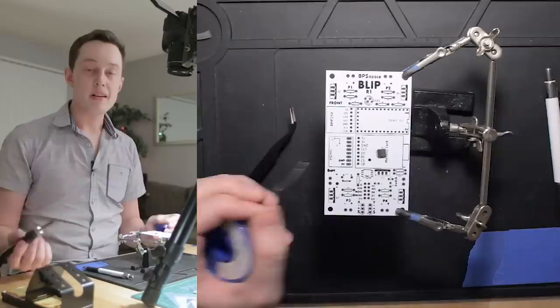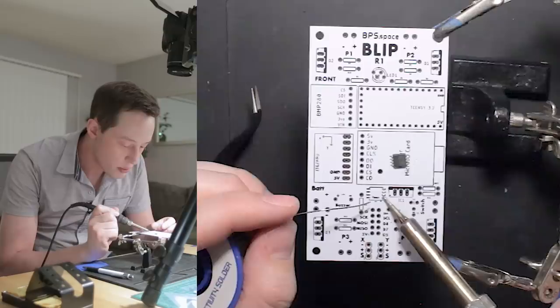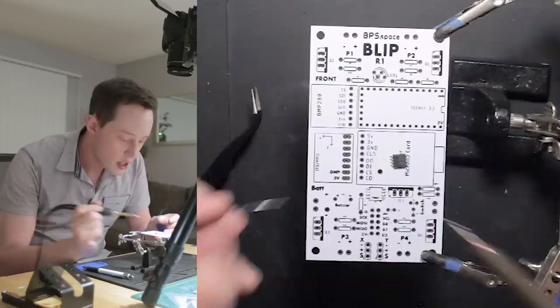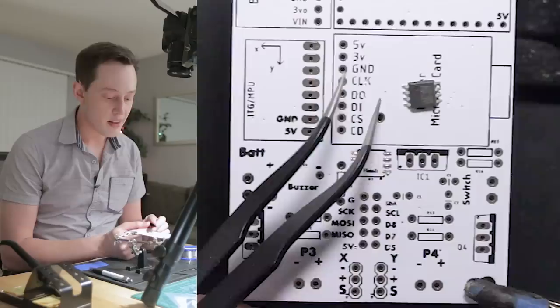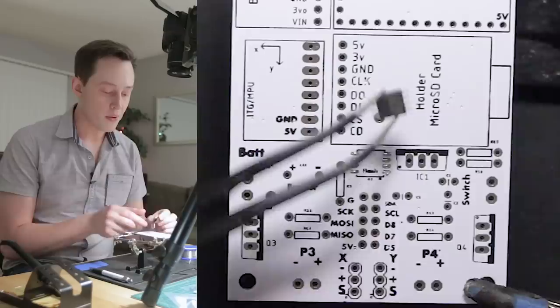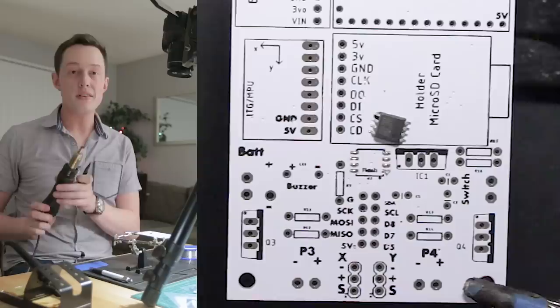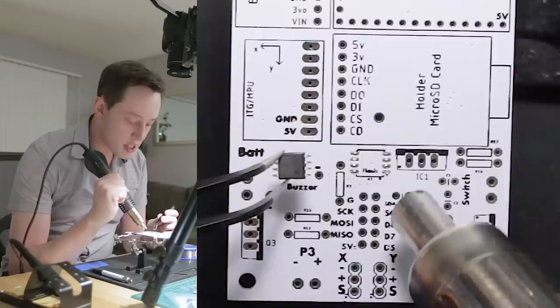These little chips come in a tiny receptacle — they just sort of slide out when you take the plug out. One thing to keep future pain from happening: always put your components back in the bag from which they came and always label your bags. This can go all the way up to labeling different bags and boxes for different production runs. Now that our soldering iron has heated up, what we're going to do is tin the tips of these little flash pins on the board. Generally speaking, for this type of application, you'd want to use solder paste, but in the interest of keeping things super simple for the Blip Board, I'm just putting little tiny globs of solder on these little pads.